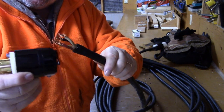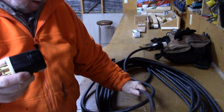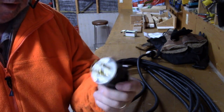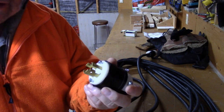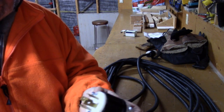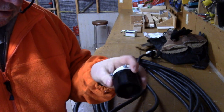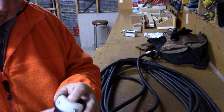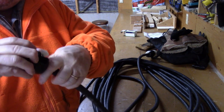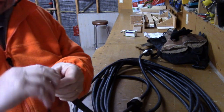I tried to get Alexa to connect the plug but that didn't work - Alexa's still mad at me. So we're going to have to do it manually today. To take this plug apart, you just take these two screws out. In typical electrical equipment you need about 15 different screwdrivers to do this job. This one happens to be a green Robertson. I'm going to put the barrel on the cable first because whenever I'm doing these, I'll get everything wired up and then realize I forgot to put the barrel on it.